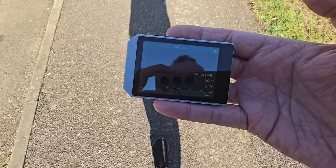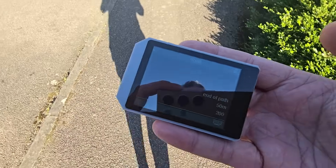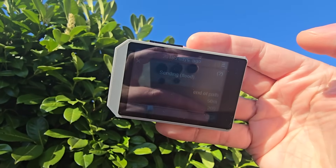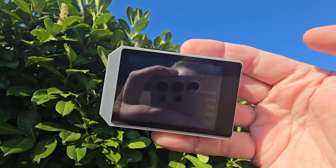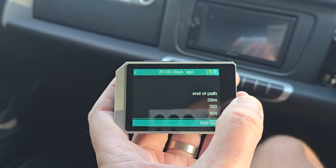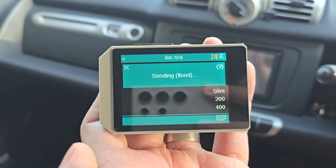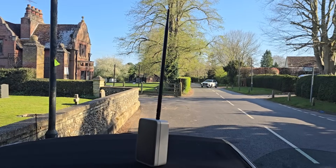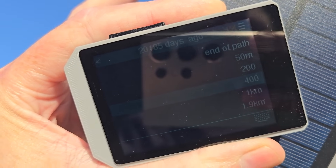Carrying on walking — this is not line of sight, so for 2.4 GHz to a tiny little PCB antenna, this is what you kind of expect. At about 400 meters away, I tried again and '400' went through as well, still two hops. Then I jumped in the car to test at one kilometer — I tried a flood send to give it the best chance. And at 1.9 kilometers away, a message went through. For 2.4 GHz that's pretty bonkers.